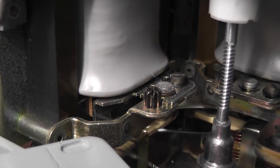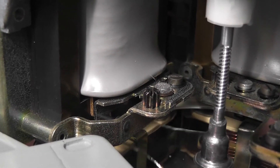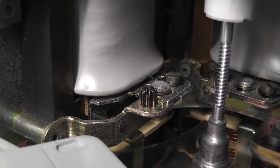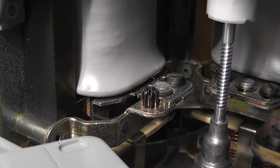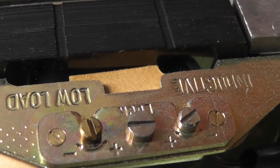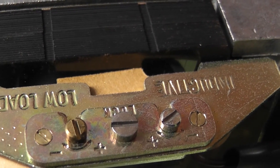This particular screw is a balance adjustment. For correct calibration, each metering element should be balanced to provide the same torque. There are two adjustments: one is for light load and one is for inductive or power factor.